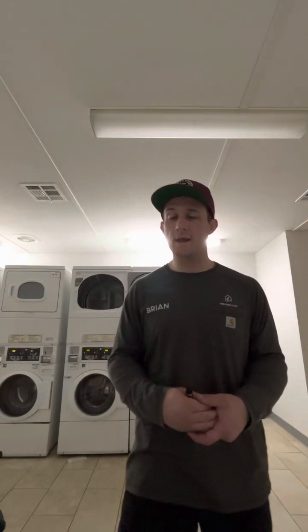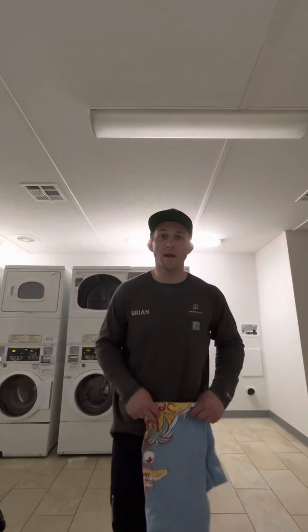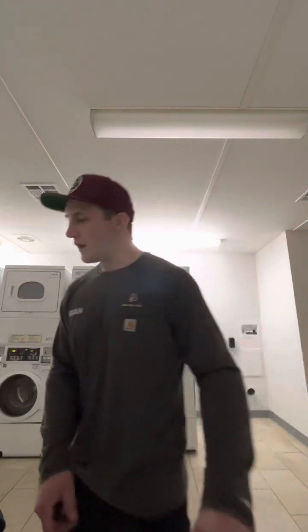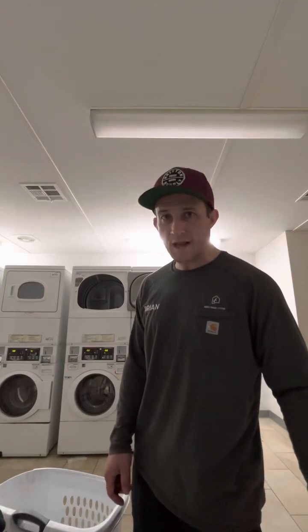say you make a list and it's 6,000 watts. I would highly recommend you not buy a 6,000 watt generator and you go about 2,000 watts or even 3,000 bigger, which gives you room for growth. It makes it to where the generator is not going to be running at full capacity 24/7. If you need 6,000 and you buy a 6,000 watt generator, it's going to be running at full capacity from the second you start it up. That puts more stress on it rather than you running it at a lower capacity. It burns less fuel. So that's the next tip. Based on your wattage requirements, oversize the generator.